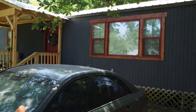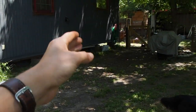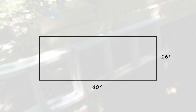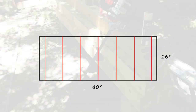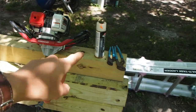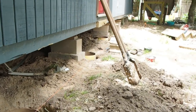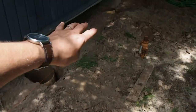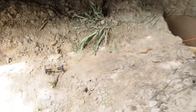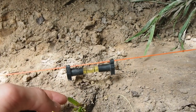Here's the plan: I want to get my house off of blocks and put it onto a pier and beam system. To do that, I'm going to be running seven beams under the house and doing 14 piers about two feet deep. We've got an auger that should help a lot. I've got my string running across that I'm using to get all of the piers level, using these little string levels — I just scoot them along the line and that does a pretty good job.